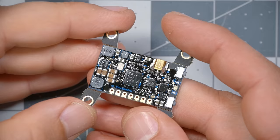After tightening the nuts, look between the boards again and make sure nothing is crushed or crimped, no wires are stuck in there, and the ESC is still not touching the flight controller — they'll have gotten a little closer together. The flight controller is a huge part of your quad flying well, and small silly mistakes people make when building their flight control stack can make the whole quad fly badly. This is just as important as I'm making it sound.